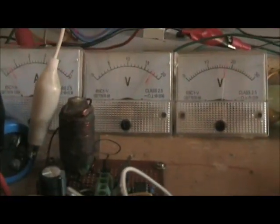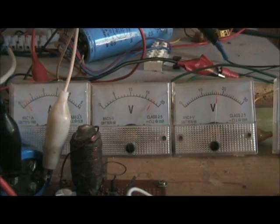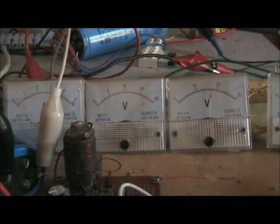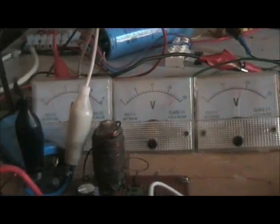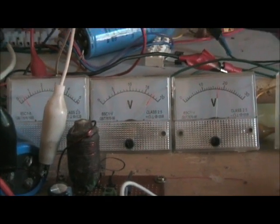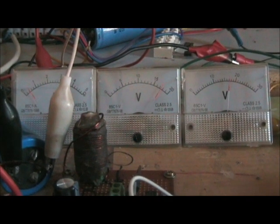It'll be a while before it comes up, seeing the size it is with the current that I've got happening there at the moment. With my way of thinking, if the panel voltage is not going up to 20 volts — if the panel voltage is staying around about the maximum power point voltage — then surely I must be getting about the maximum amount of current from the panels. It will be difficult to really know until I get full sun in the summertime, but the action of the program seems to be at the moment working fairly well.